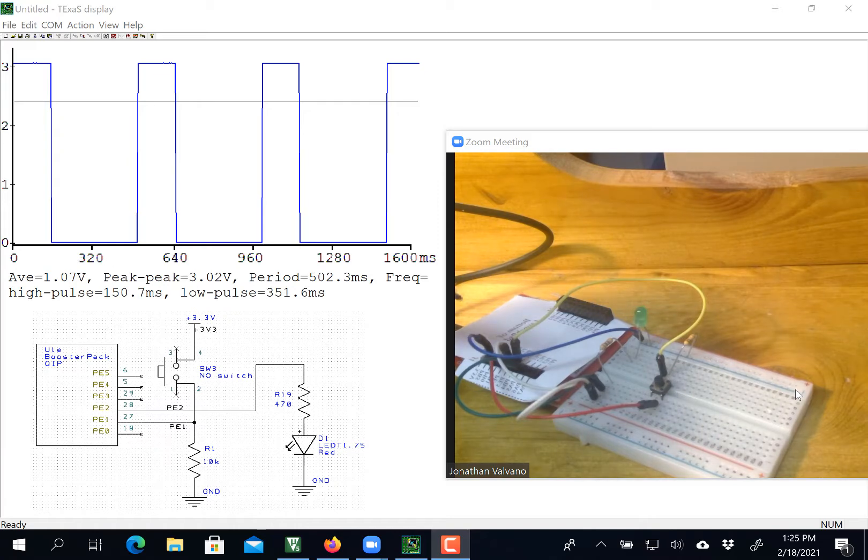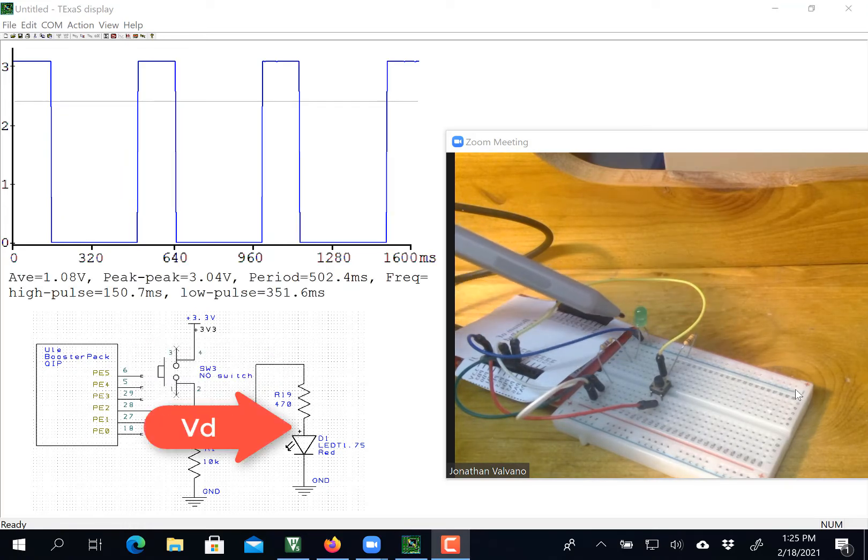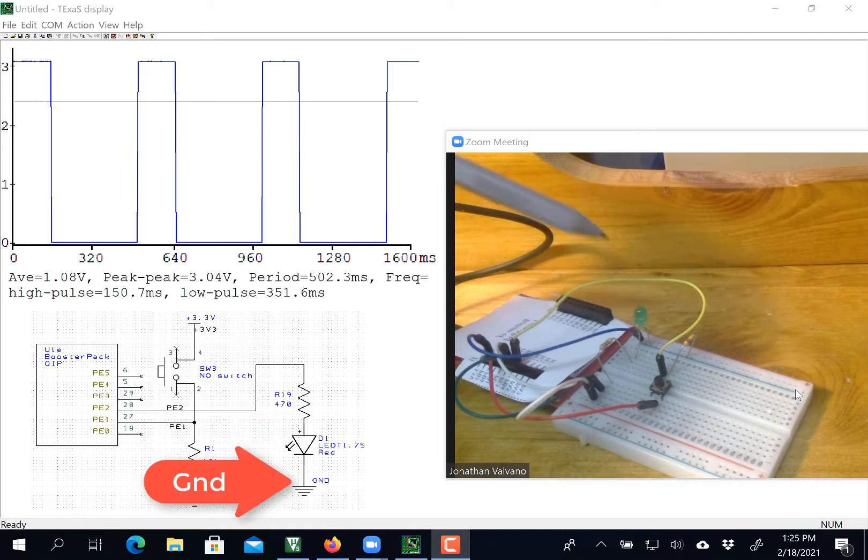The output's just as simple, and that here is this green wire. Here is my output pin, my GPIO output, which is tied to the resistor — that's the 470 ohm resistor — tied to the plus end of the LED, and the minus end went to ground.